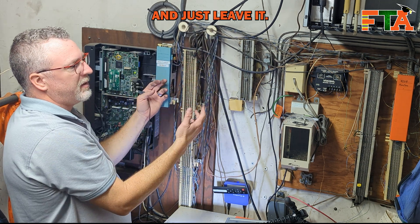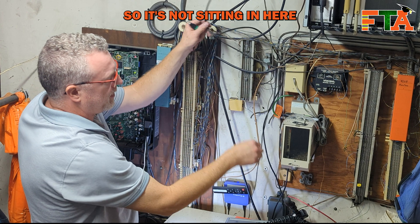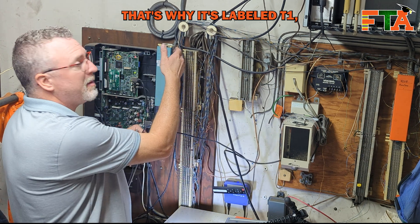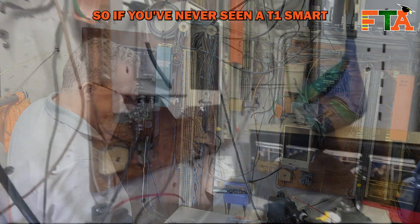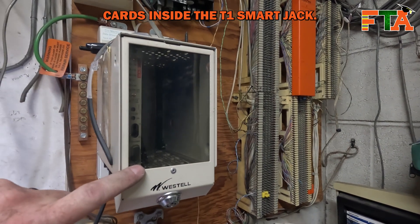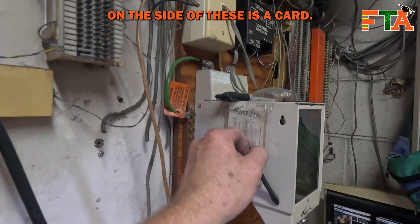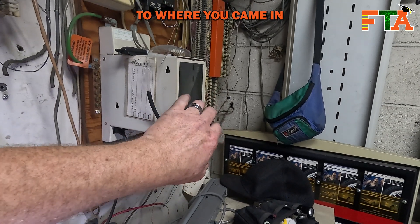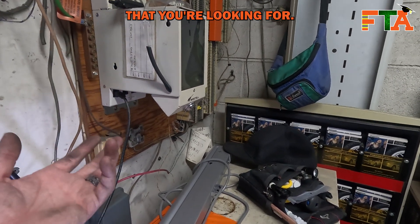It drives me nuts when guys unplug a cable and just leave it. We're taking this out of service, so take the two minutes to pull this cable out of the system. In the past this was used for their T1 - that's why it's labeled T1. This cable goes over to the T1 smart jack. If you've never seen a T1 smart jack, you've got plugs along the bottom that correlate to cards inside it. In this case there's just one card, meaning there was just one T1 signal coming into the building. On the side of these is a card that will typically tell you the circuit ID for that T1. If you came in and there were multiple cards, you can look at your work order or talk to your client and they should be able to tell you the circuit ID for the circuit you're looking for.